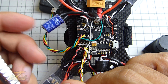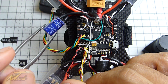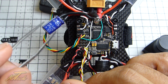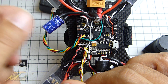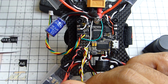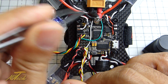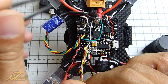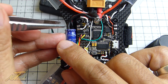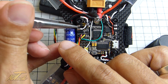It's something I've always done and will continue to do for the foreseeable future. Unfortunately I couldn't fit a 1000 microfarad — it's a bit too big on this build — so I've had to go for a 470 microfarad, 35-volt high temperature radial capacitor. Because I've had to extend it away — there's just no room to have it poking out the back or under the flight stack — if you do ever extend the capacitor away like this, use some decent thick cable to keep that ESR nice and low, and plenty of solder when you're joining it in.